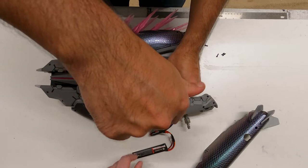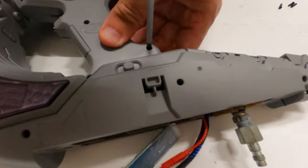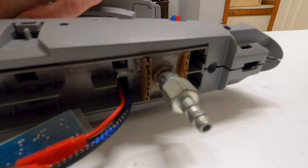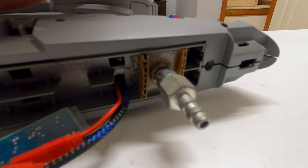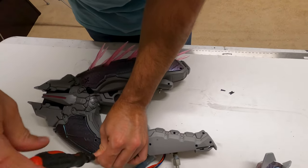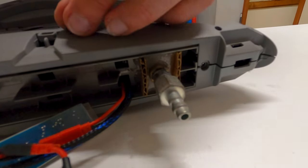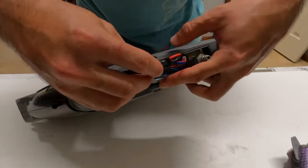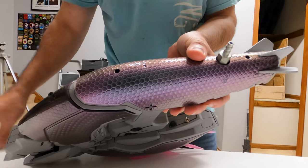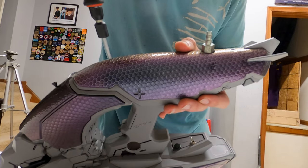Do you actually use the on/off switch that was originally on the Needler? It's glued in place now. You said this tap down here was epoxied? Yep — put up cardboard walls so that it pools around that, then poured in a bunch of epoxy and let it cure overnight. Now that fitting is nice and secure and ain't going anywhere. And if I do need to remove that part, it's got a push quick connect fitting on the other side for the Polar Star's airline. It actually works quite nicely with the two battery trays — put the FCU in one side, put the battery in the other. The Phillips head screws on this bottom plate are captured so they don't fall out.